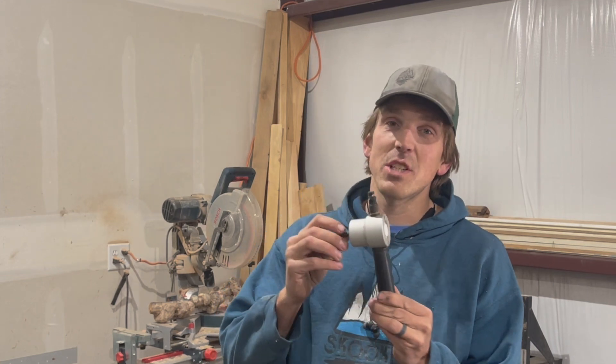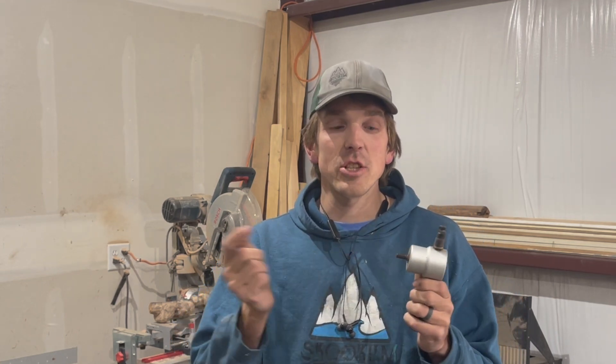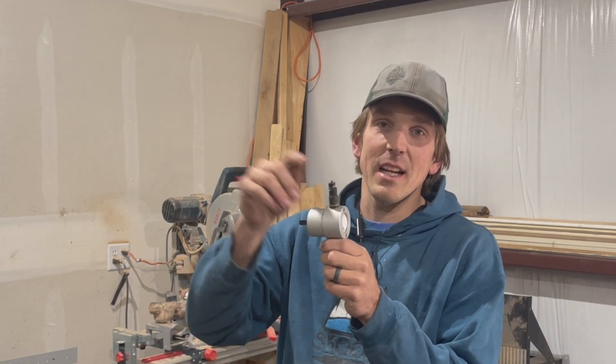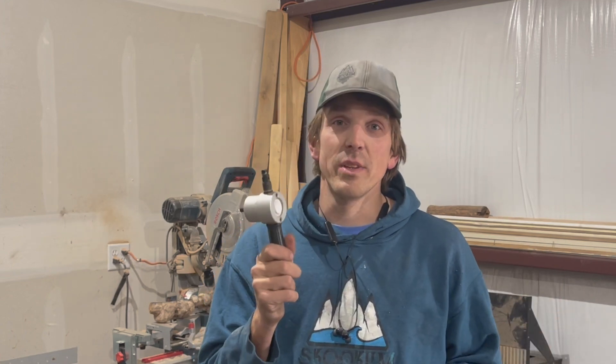I have a piece of sheet metal from another project that I made, which is cut out in the shape of the Tetons. To do that I used this thing called a nibbler. You attach it to a drill and as the drill spins this little piston goes up and down and it cuts off little half-moon shapes of metal, and you can go in all sorts of fun angles. I'll show you how it works so you can see what a neat tool this is.